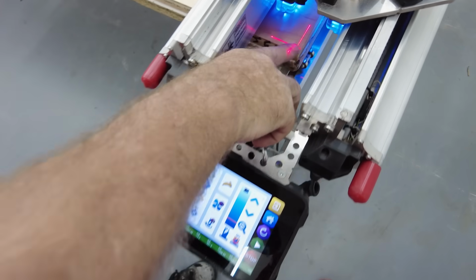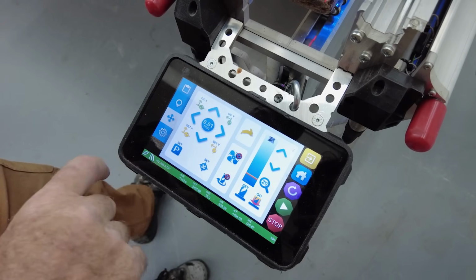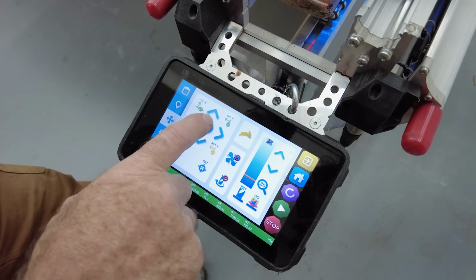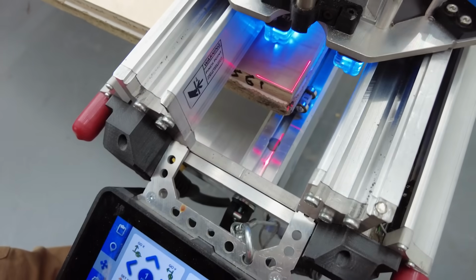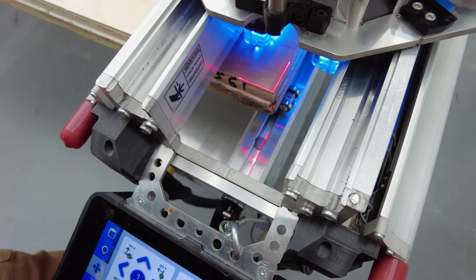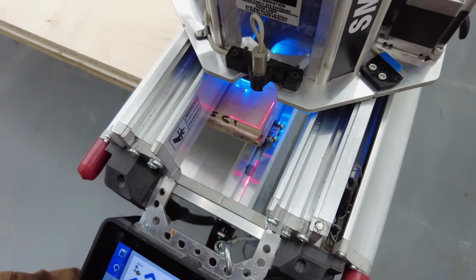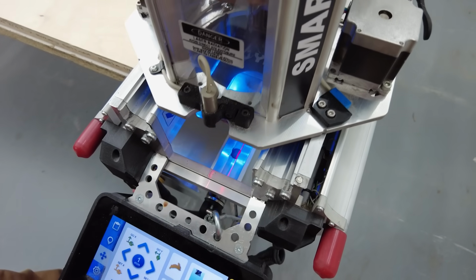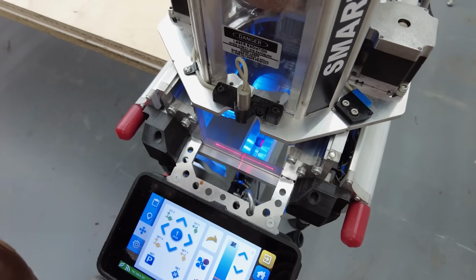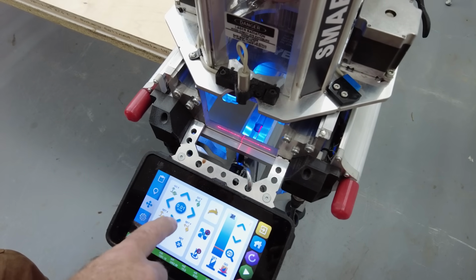So this has a laser on it, and I can change the increments from 10 millimeter, 1, 0.1, 0.01, and then I can just hold it down. But I want to go down to 1 millimeter. Oh, and it just jogs over by a millimeter at a time? Yep. And then the laser's out here with the spindles back here. So it just knows now? Now it knows where it's at. So that is directly above that corner. So we've set that. I'll go back to...